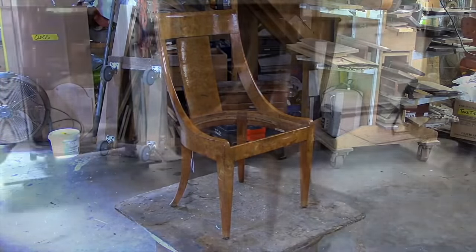So now, I think I'm going to turn this desk upside down, because I also need to establish the center point of this pad on my new piece. So now I'm going to take measurements from these legs and draw arcs in the new piece, and where those arcs intersect should be my pad here.